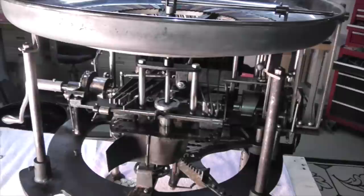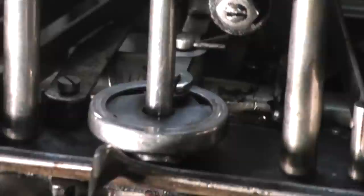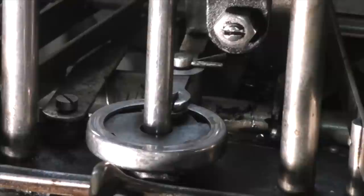That's done through a ratchet. Let me zoom in on it. That's right there. And the way it works is there's four small little ball bearings inside this ratchet, and so basically it allows the wheel to spin in one direction, and that's clockwise. So during the windup, the cam will cause the ratchet to move about probably 45 degrees counterclockwise, which basically winds it, and then it will force it to move the other 45 degrees clockwise, which engages the wheel to start spinning.